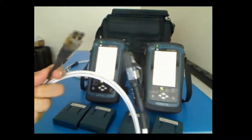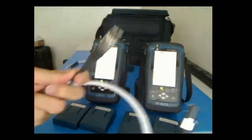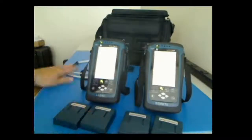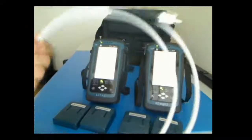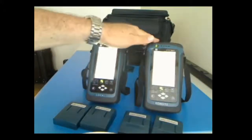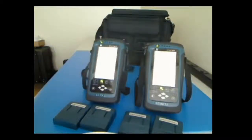The other two pieces we have are the link cables for doing a permanent link. They have the Terra connector on one end and RJ45 on the other. We have two of those. What we're going to do first is set up a permanent link test, which is probably what you'll do a lot. My next video will show how to actually set up the screens to do the permanent link test.